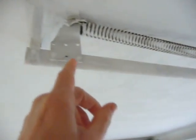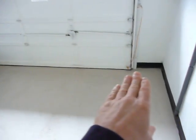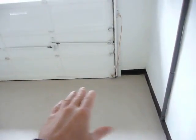We've put new track cables on both sides, adjusted the tension. We've shored up the bottom with concrete where it's all leveled out now. We had like 3/8 gaps on both sides, plus put weather strip. We don't have that issue there anymore. We've put border around to help waterproof it. We've made all the repairs against the wall here.